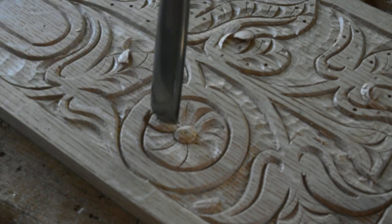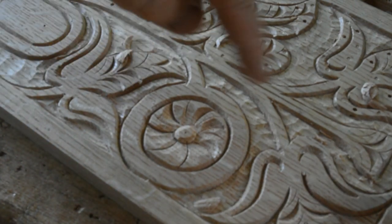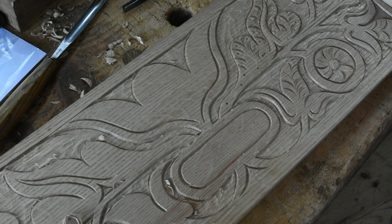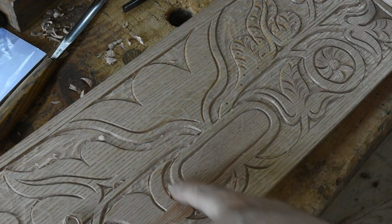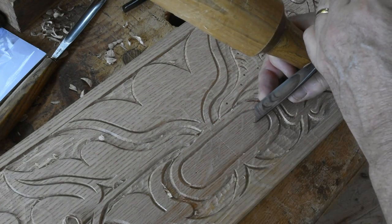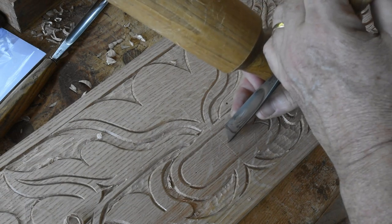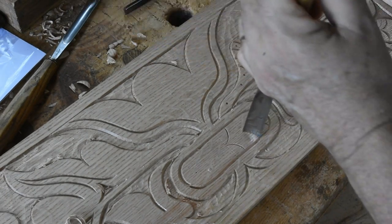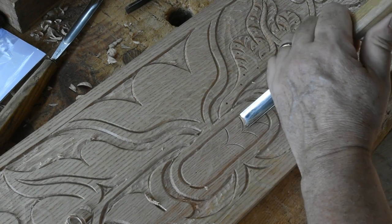Then you come behind one and take that chip out. From there it's just the incised ones that don't get chopped out — so that's all there is to that pattern, very simple. It has the nail set punch around it and even within those petals. Now the urn: the first thing I did is an interior V-tool line to create a border around it, and now it's just a couple of chops with the gouge. I'll put the center points of those compasses in one of these to make them disappear, and then one radiates out from the very center, and then one in between — what could be easier.